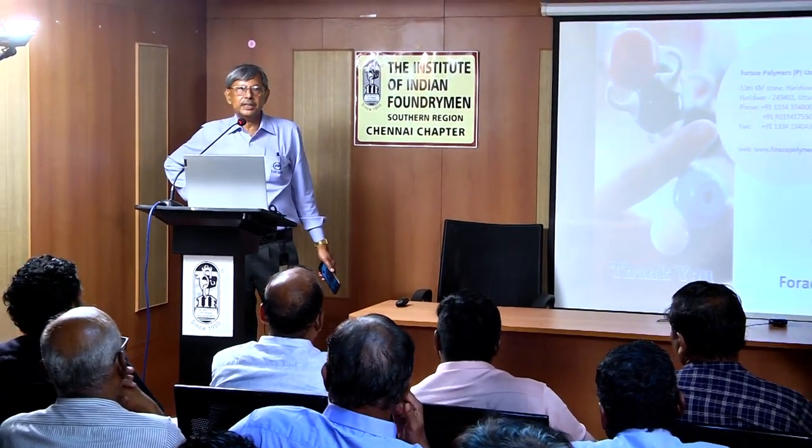What happened in some cases, is it only in one or two cans or all? No, sir, many cans. There is a possibility, because of a single supply. In some cases, suppliers use some components as a masking agent, so that is possible, it becomes spongy. That means it has reacted with amine. Whatever is there, that material has reacted with the amine and becomes spongy. If it is in all the tanks, something serious is there, but if it is in one or two drums, then it must be contamination. You are telling that to reduce the smell they are adding masking agent, right? So that creates an issue.